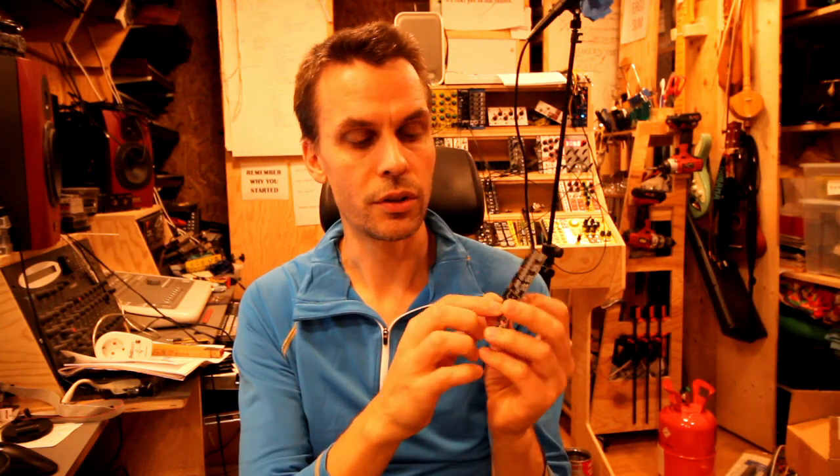Or if you forget to write it in the message, just send me a message and I'll include one in your order. If you've bought more than one of these before, I'll of course send you multiple of these. Just be aware of that little capacitor — I'll mark it with a small red dot so you know to turn it the opposite way from the silkscreen, which is the correct way according to the schematics.